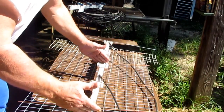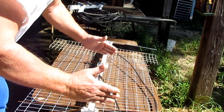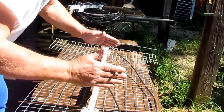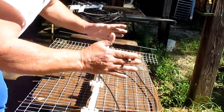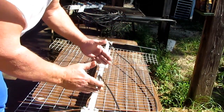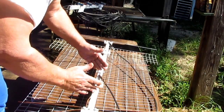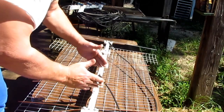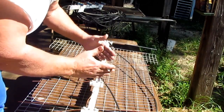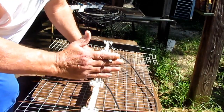When I went to a customer's house to install one, I had been testing without the booster. But when I put the most powerful booster they make on it, it picked up the same channel on all the channels — it was too much dB gain for this antenna. I've tried it several times since and it won't work. So I dropped back to the 7778 and that cleared everything up. You can't use the 7777 with this antenna.